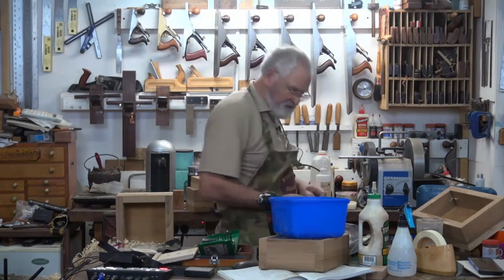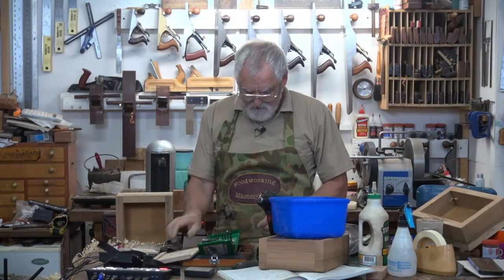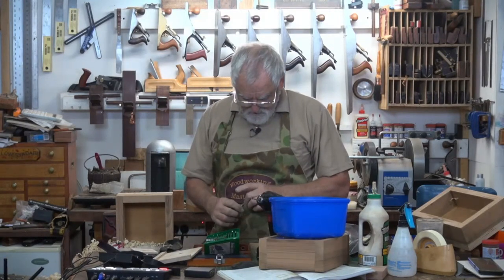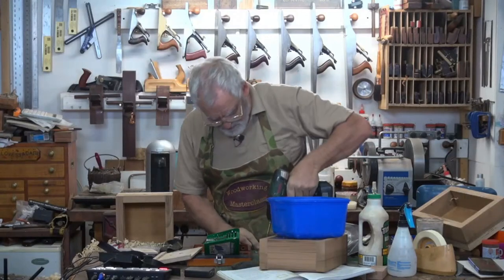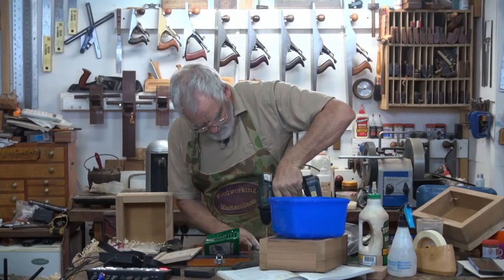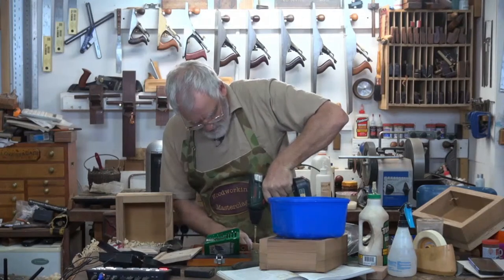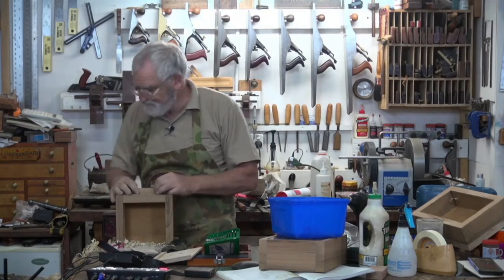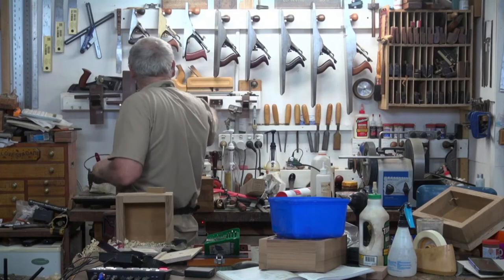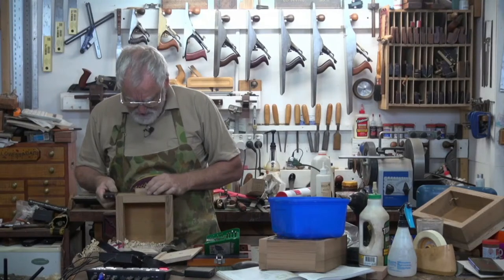And what I'm going to do is go down deeper, which is going to be this one here. Or will I? Yep. I could countersink these, but I actually like going down a bit deeper. And then I can fill it up. A lot of times I'll use wax or just wood putty. But that way you don't get the screws exposed, and it doesn't look as bad.